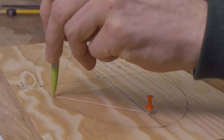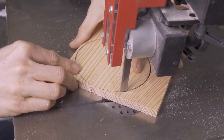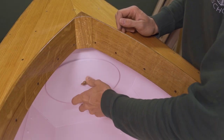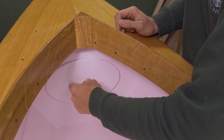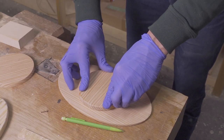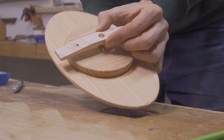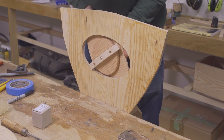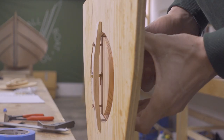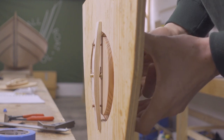Now I'm turning my attention back to the inside of the boat. Here I'm building the ingenious little hatch covers that are used to seal off the watertight compartments at each end of the boat. These covers consist of an oval and a round piece of wood that I glue together. Behind the two pieces there's a clamping bar with a threaded insert in it. The hatch cover is installed by twisting it into the oval hatch opening. Then the thumb screw is turned to make the clamping bar pull the cover tight.